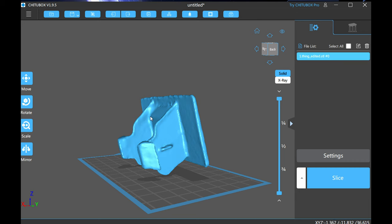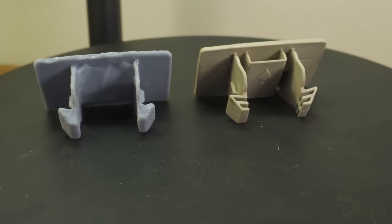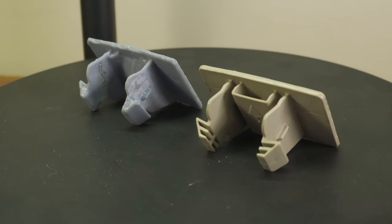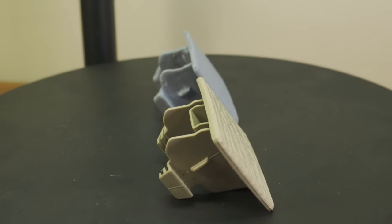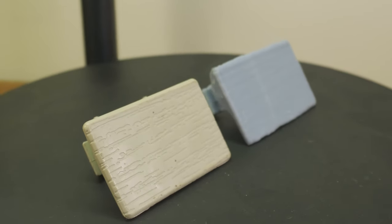I'll take it straight into the slicing software for my 3D printer. After scanning and printing I have a part, and here it is beside the original. The printed part is in gray — you can tell we lost a little original detail, but dimensionally and functionally it's pretty much spot-on.